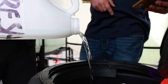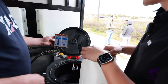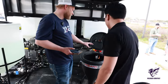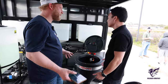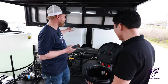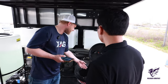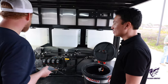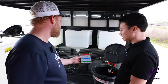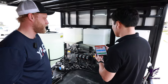It has a little lag in it too, so you're good there — I'll slow down a little bit. 64.9 — close enough, let's send her in. It would have a little variance from the wiggle of the trailer, which is common. But here's your three chemical outputs: you'll have a chemical here, here, and here, and you can put as many products in at one time as you want. You've got your jug rinse function, your valve stack that controls it, and here's our batch tank that everything's going into. We've got literally 10 gallons left to run in and our batch is mixed and we'll fill the drone.